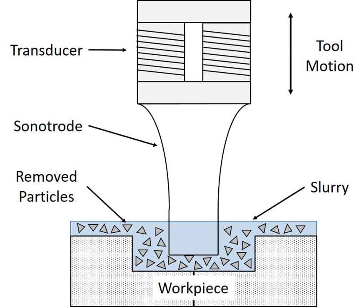Ultrasonic machining is precise enough to be used in the creation of microelectromechanical system components such as micro-structured glass wafers. In addition to small-scale components, ultrasonic vibration machining is used for structural components because of the required precision and surface quality. The process can safely and effectively create shapes out of high-quality single crystal materials that are often necessary but difficult to generate during normal crystal growth. As advanced ceramics become a greater part of the structural engineering realm, ultrasonic machining will continue to provide precise and effective methods of ensuring proper physical dimensions while maintaining crystallographic properties.